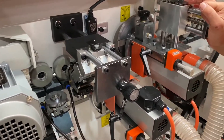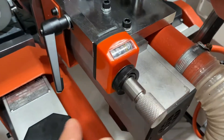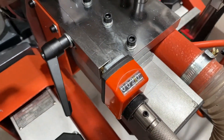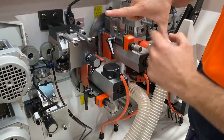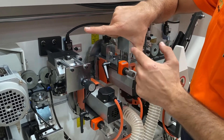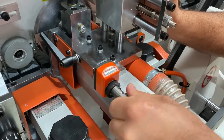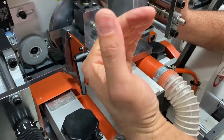When changing to different thickness edge tapes — say going from 1mm to 2mm, currently set for 1mm at about 1.3mm to give a slight radius — loosen off this knob and adjust it up. For 2mm edge tape, go to 2mm and lock it off. Do the same on the bottom: loosen that and adjust it. The cutter is shaped to cut top and then bottom — we push the cutter in to cut more on the radius for 2mm, and pull it back for 1mm. When going back down, like your pressure beam, go past it and then come back up to your size — that gives a more positive reading and is a lot more accurate.